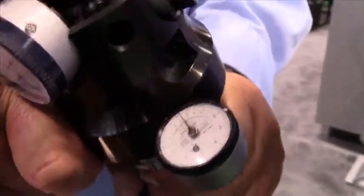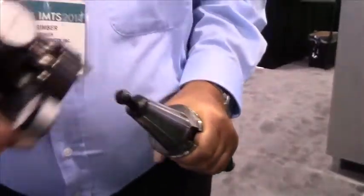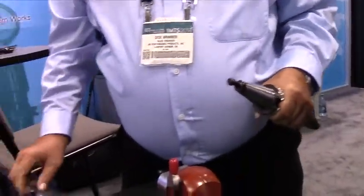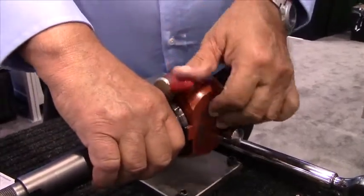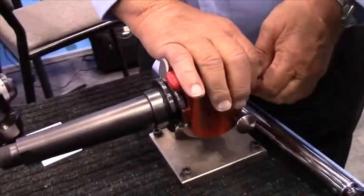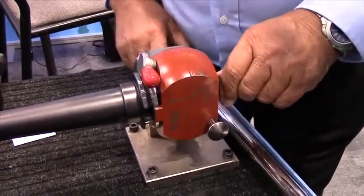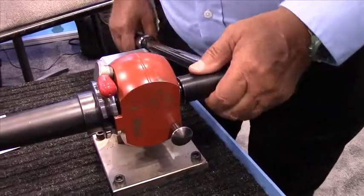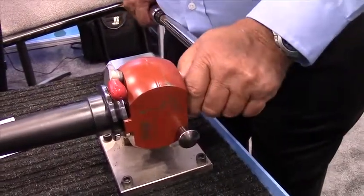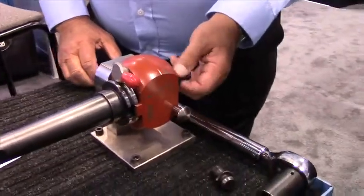This in turn will lead to about a 20% increase in tooling life and also an increase in spindle life. Note that this should be torqued on a normal CAT-40 machine at 30 foot-pounds, but we used 60 just to show the same tightening effect on the holder. To learn more about JM Performance Products, please visit us at Booth W-2179 in West Hall. Thank you.